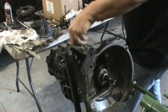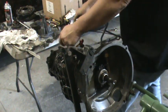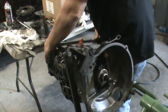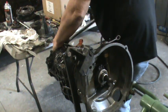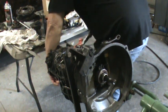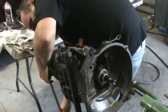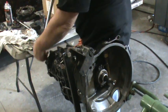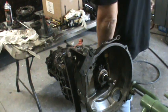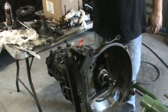I'm going back around — they're all torqued. Double check, triple check. I hit the gearbox even though I didn't have it apart, because I don't reseal the gearbox — that's part of a rebuild. When you take the gearbox apart, stuff falls out of it and it's got to go back in a jig. If I'm going to do all that, I'm going to do a synchronizer and papers at least. So I re-torqued that — hopefully that'll slow the seepage down.